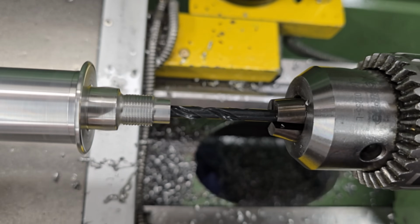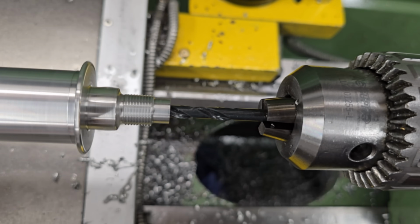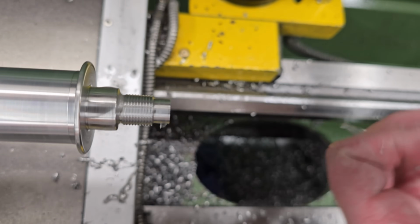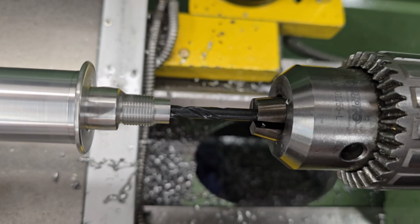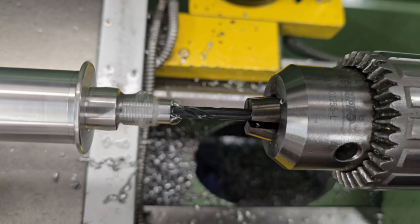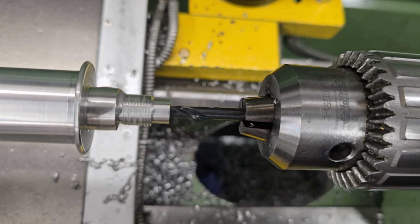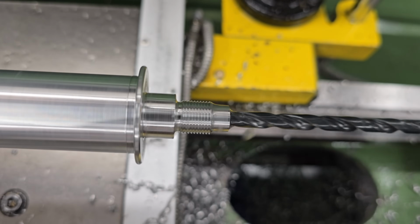However, I can only ever test the rifles 1 day a week, so getting all the way down to Pete's airgun farm to find out the rifle's clipping is a little annoying. So I always go to 6mm for .177 rifles and 7mm for .22. It gives 1.5mm of clearance between the pellet and the hole, and I've never had a problem with clipping issues.